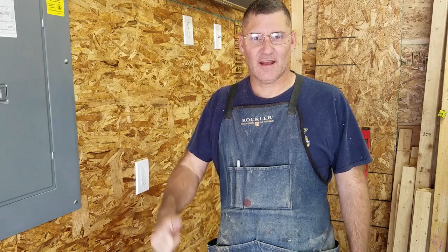That was fun. We're going to go ahead and hang the cleats now. I'm going to shoot them in with some brads and then come back and countersink and screw them into the studs. Let's get started.